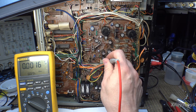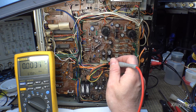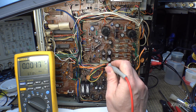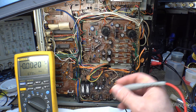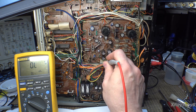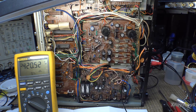The next one is a ground. These next two thicker wires contain your filament voltage — reading between the orange and the brown in AC, you should see 7 volts AC for the filament. Riding on that with respect to ground you should see the high voltage, which is 680 volts — negative 680 on either side. We're seeing negative 421, and it should be about the same on either side, and it is. Everything seems to be working properly while still on the current limit.